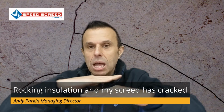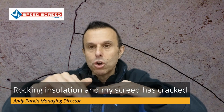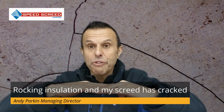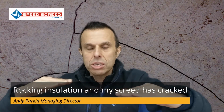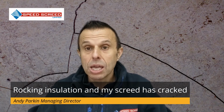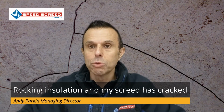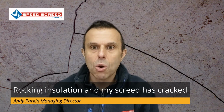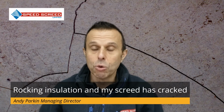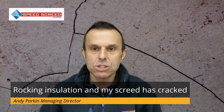The insulation should be laid very tight, with buttered joints. It should be laid in rows that alternate, so the joints aren't all lined up. And good practice is to always tape the joints as well, so that creates a more stable substrate for the screed to go onto. By the sounds of it, you've not had that. I think your worst fears have come to fruition, and the screed is cracking.